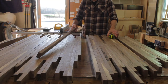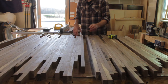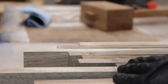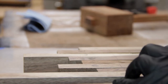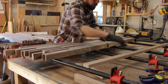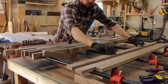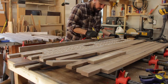With every project I take on, I try to expand my skill set, especially if I've made it before. With this project, I took on figuring out the best way to glue up something so massive. Gluing up roughly 45 strips at once felt like I was just asking for trouble. So the easy fix was to break that up — for me, that was three sections that could then go through my planer after the glue up. The next tricky part was getting seamless joints in the middle of the board where the shorter pieces met. Again, small problems with simple solutions equal a yes-I-can-do-that outcome.